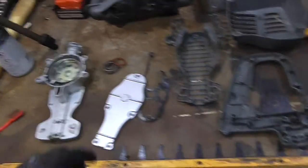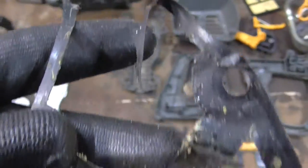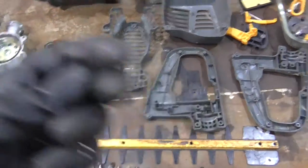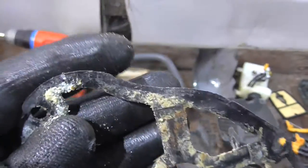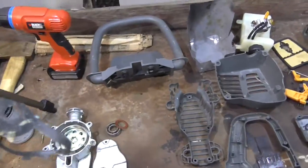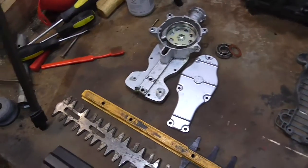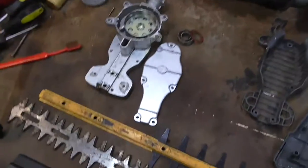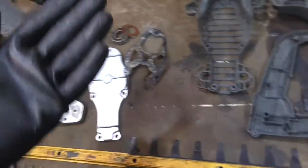So that's one other thing. Another thing — a little gasket. That was going to have been completely and utterly ruined. Water damage, pulling it apart hasn't done it any favours. All this oxide from the base material, which I'm guessing is like a magnesium-aluminium amalgam. I'm trying to scrub a bit off but it's not coming off. So that would either have to be replaced or remade at home.